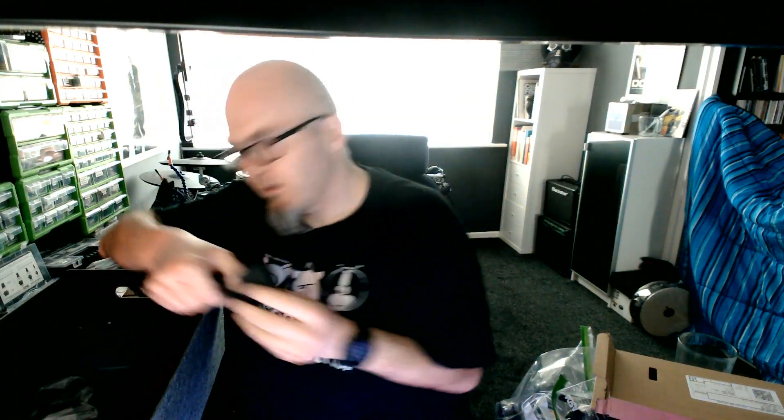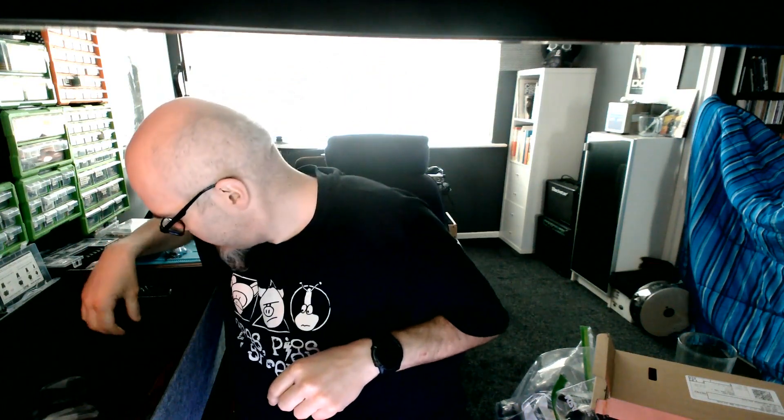My first bit from China was my screen. It doesn't actually do very much at the minute because there's nothing to plug it into — I still haven't got a control board. Threadlocker Blue is recommended on the Bill of Materials. I couldn't find it and bought a cheap Chinese version in a tube rather than a stick. Turns out you get it in Halfords. That Brexited channel in Discord is the source of lots of knowledge. I've also got one 3D-printed thing from the user mods: a tool for lining up your rails. You put your corner rail in, put your side rails on, and tighten them up while pushing down so everything's nice and level.